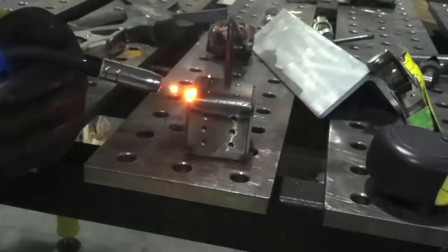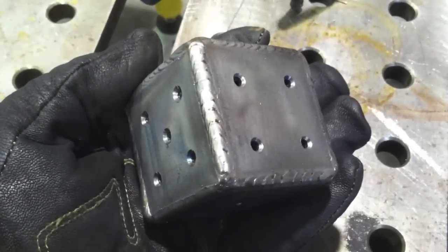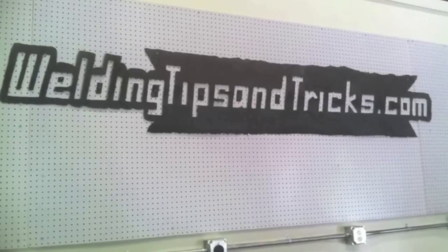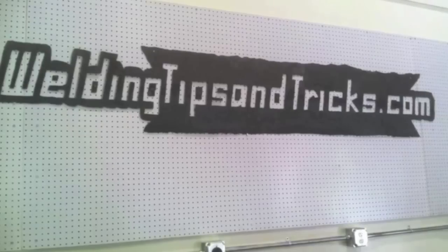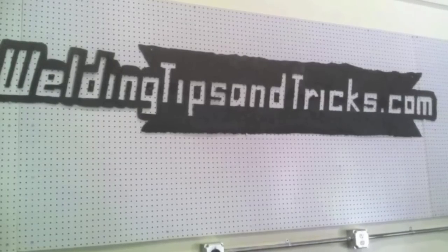That's always the case when you're doing a welding project — there's always something that's more important than others. Sometimes penetration is the most important thing; other times sealing and just appearance are the most important thing. A little ornamental thing like this, it's strictly appearance — it ain't going to fall apart. I hope to do a whole bunch of these using different techniques like overlaying with silicon bronze, or making one out of stainless and putting some heat tint on it. And I hope some other people will post their videos making ones out of aluminum and things like that. Thanks for watching.